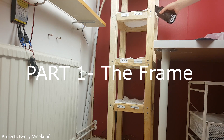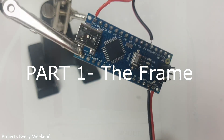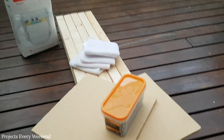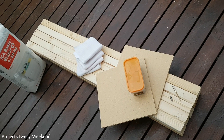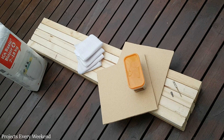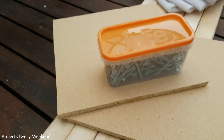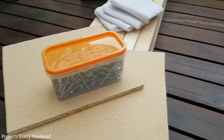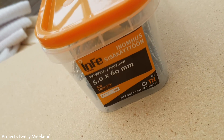So you want to start with the main structure. The part where we will install the electronics and watering system will come out next weekend, so stay tuned for that. I started off with some lumber — I bought 10 45x45mm, 120cm long lengths, but ended up only using 9 of them. Always smart to have an extra just in case. I cut two 30x30cm MDF sheets and used 60mm long wood screws to hold everything together.